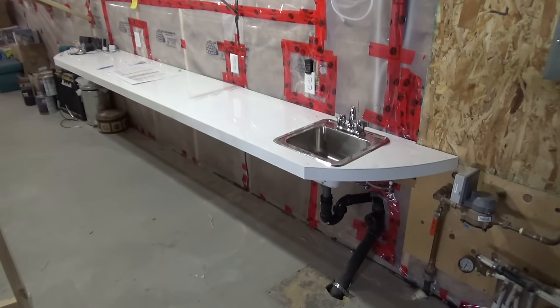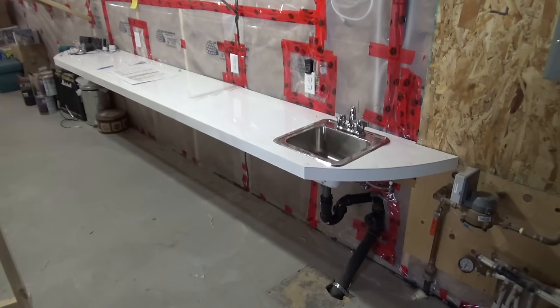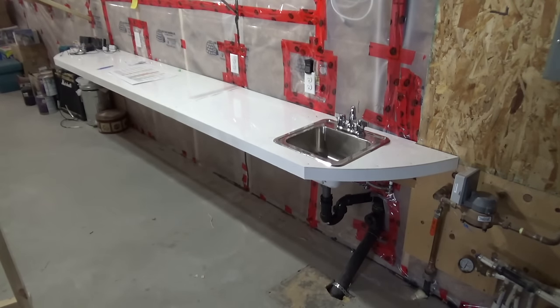When I started off doing the countertop, I was drilling holes and countersinking white screws in. And you can kind of see on that, there's a seam right here. And I wish I would have known that gluing it, because I kind of tested one with just gluing the glossy surface and it didn't stick very well. So I gave up and I was just putting screws, and then I kind of had an epiphany that, well, maybe I should try sanding it. And once I sanded it and used a polyurethane glue, man, is that ever solid.